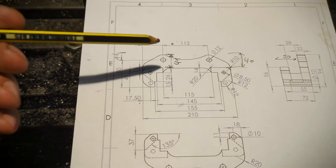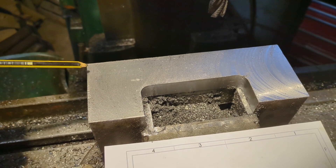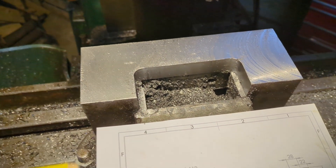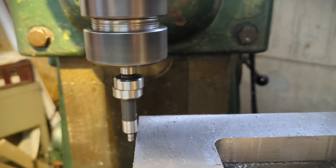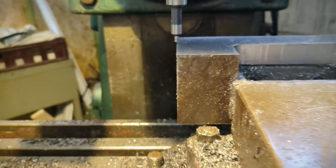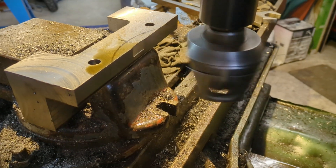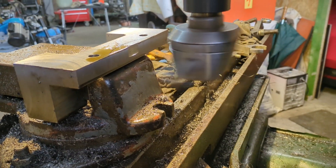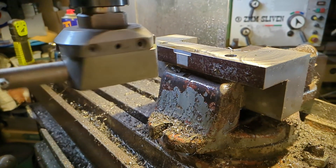I now have to make the bolt holes in the caliper bracket that connect it to the hub. Since my piece is still square in the corners I can measure it from the edges. I got my edge finder and moved it half the diameter to have the zero point on the corner of the workpiece. Since my piece was clamped in this orientation, I also made the radius cut on the back, since I had already dialed in my coordinates after drilling the bolt holes.